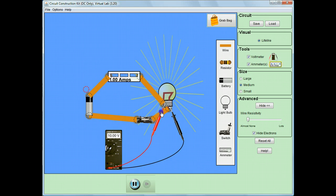And it turns out that I'm losing it right in these filaments, basically. Okay? So right in the side of the light bulb here is where I'm losing all of the energy. And you can see that, actually, it's coming out as light. If I go over to this side, so everything's on the exit end of the light bulb, I have 0 voltage again.